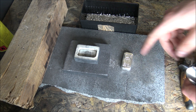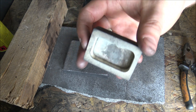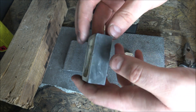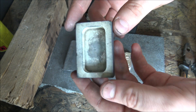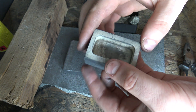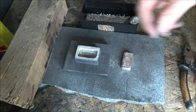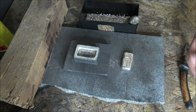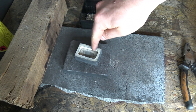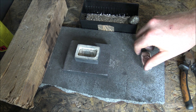It's not as easy as just pouring 100 grams of silver into this mould. This is the mould I'm using — just a standard mould I bought off eBay and I've had it for over two years. It's one of the very first moulds I bought. A tip for anyone looking to get into silver pouring: this was my first mistake, because when I was looking to buy moulds I found what looked like a five ounce mould, but of course it was five ounces measured in gold rather than silver. So when I got it, it only takes two and a half to three ounces of silver. When we pour into here you'll see I'm aiming just for the very top of the lip, which should yield about 100 grams.